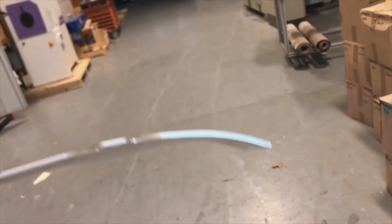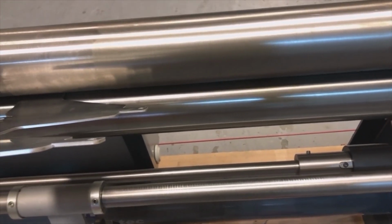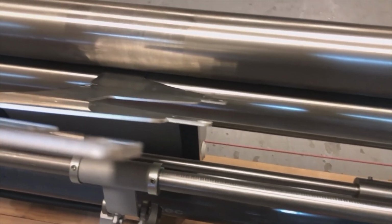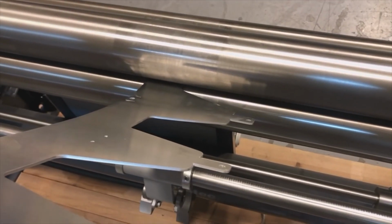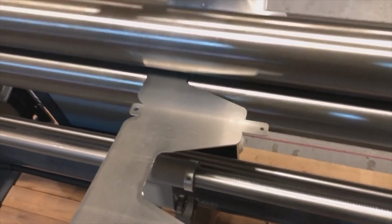Now the roller is coming up and it is pre-bending out. I kept the pre-bend short at 120 because I think this will work better. So this is all we are having in the pre-bend here. And then I put the part, whoops, excuse my poor camera skills. Again, you want to be nice and square against here. And then it takes that part away and it comes around.